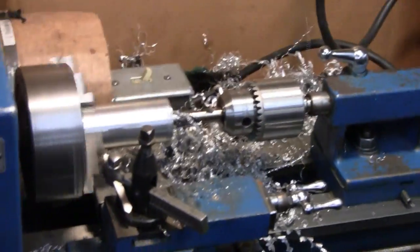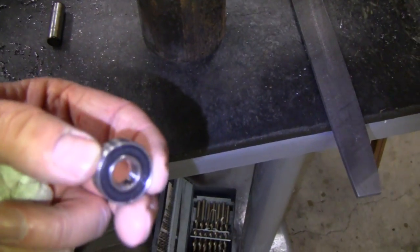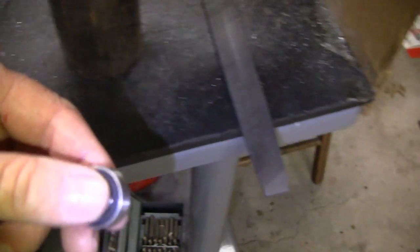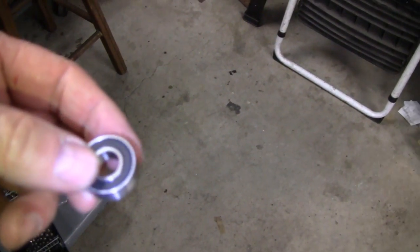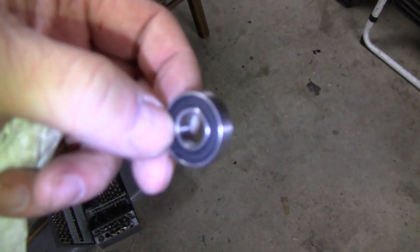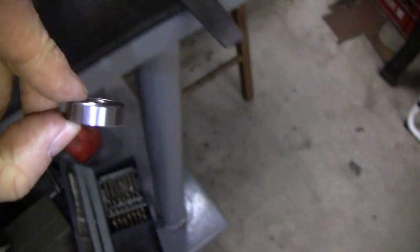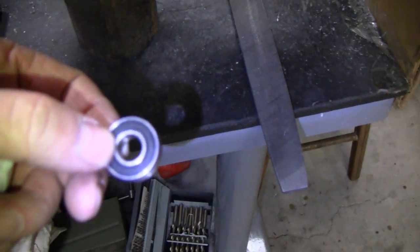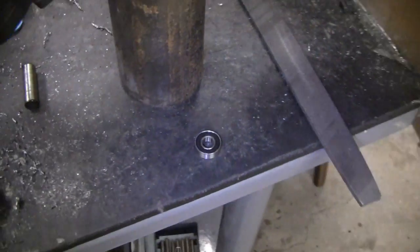Here's a little tiny bearing that Mike is making these things for. Are you going to take the seals out, Mike? You really don't need them — it's going to be on the inside of the engine. No, I'm going to need two or three of them to have a seal on one side, just the same concept as the crank. But the front side — I can take both seals out or leave one seal in, because there's going to be no hole to the front end plate.